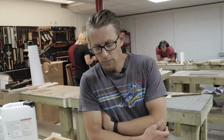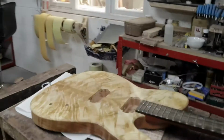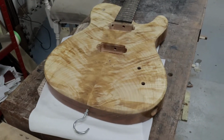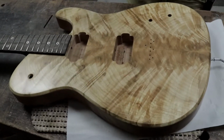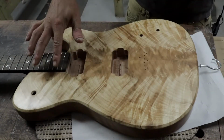Absolutely, and that is something that happens a lot with stains. You end up with patchy woods. Yeah. Now, this guitar over here, you were talking about having some issues with exactly that, slightly harder sections of wood, slightly softer. With the first coat, possibly the second coat, there were a few areas that weren't polished as well as the rest, and that could have been two things.